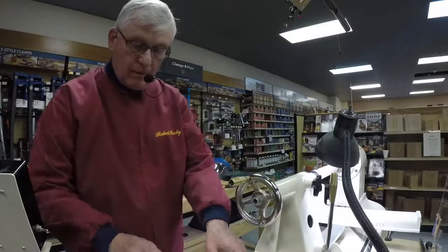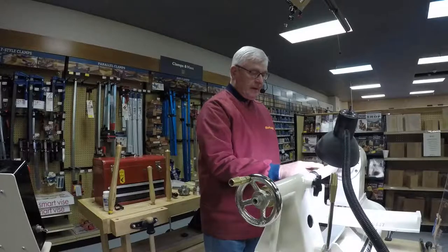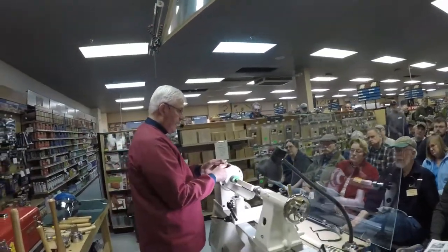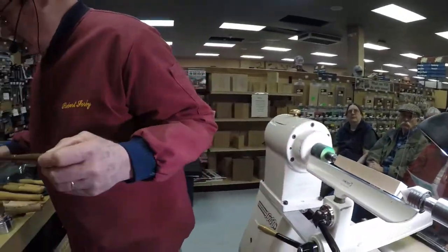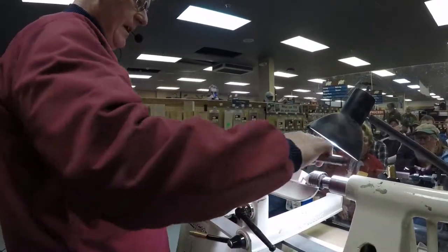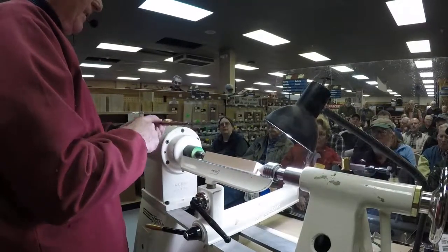What I'm going to do first is about half of the pen. I'm going to do the pen end that needs to go through the holder, which would be this end here. And then we'll have to drill all the way through, using this 1/8 inch drill to go out through here. That's why it's important that that goes in straight. If it doesn't, then when you turn this end up in here, that's when things are going to happen.